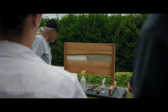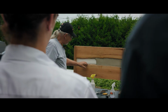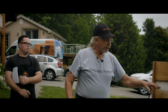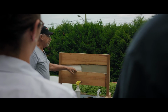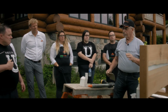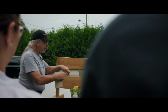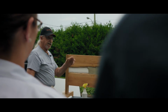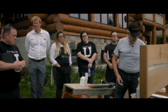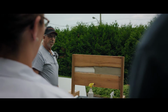That's basically all there is. Given this bevel here, that's what gives you a lot better adhesion. And make sure, if it's an old log house, clean all your logs off. I usually scrape them. I'll take a paint scraper and scrape off the top of the log to get all the fuzz and the dead wood off, because you want to bond to something that's good and solid. And you do that, and you won't have any problems.